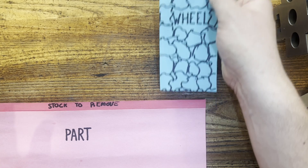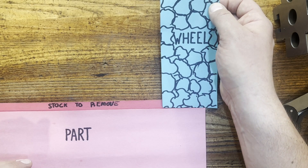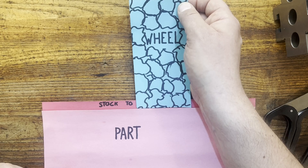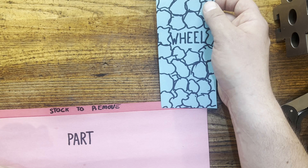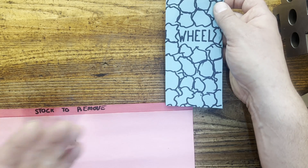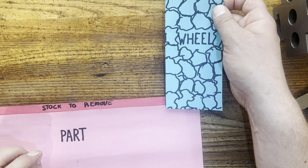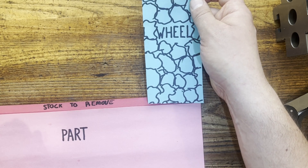One scenario is on an all-manual grinder, because we don't really have to move the head up and down all day for various parts. If we're doing a batch of parts we can just go right to our size, leave the wheel head where it is, and just feed the part or feed the wheel back and forth — never having to move the elevation. That's a really stable way of doing work. Also, the roughing is concentrated to the first 25% of the wheel and the back half acts almost as a wiper, so you tend to get quite a good finish even without the spark-out.